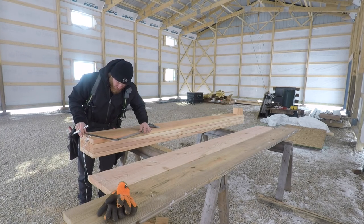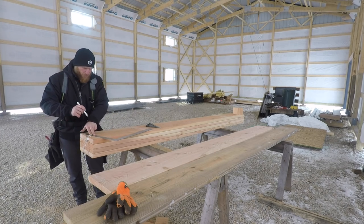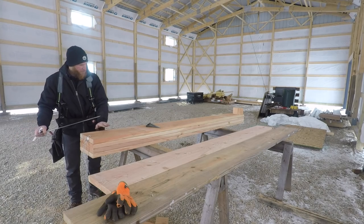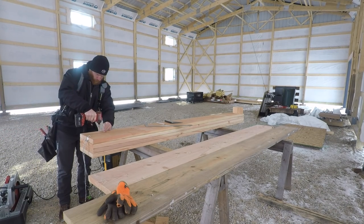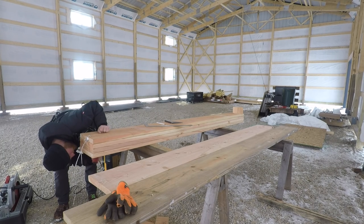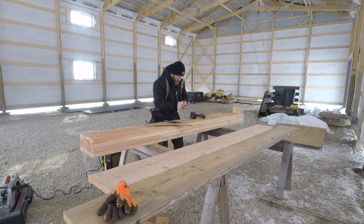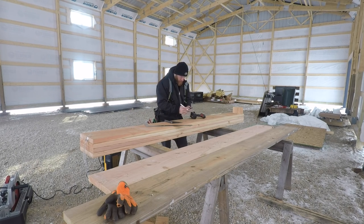What I'm doing now is cutting my rafters using a framing square with a 4/12 pitch — coming up four inches over twelve inches. Nine-foot run, four-inch pitch gives a three-foot rise. Four-inch pitch, three-and-a-half-inch run — three and eleven-sixteenths. Three foot minus three-and-eleven-sixteenths gives a rise of two foot eight and five-sixteenths. Four-inch pitch, diagonal is eight feet fifteen-sixteenths — eight-six-three-six.